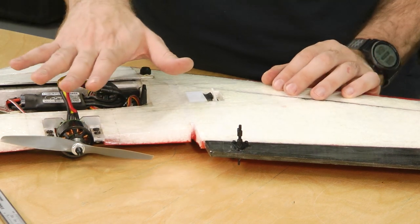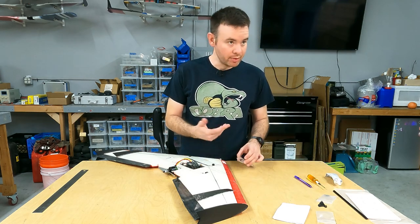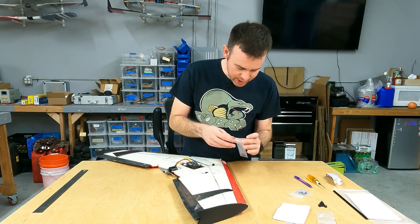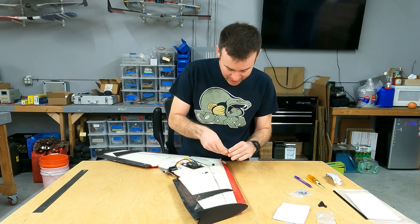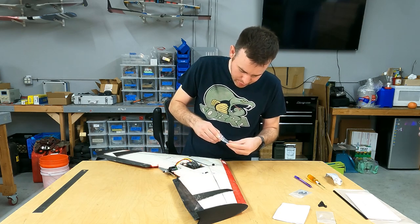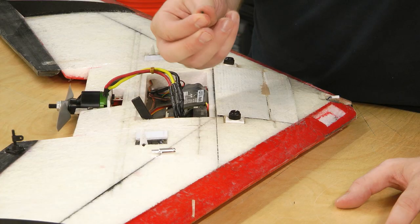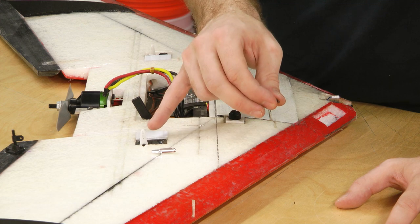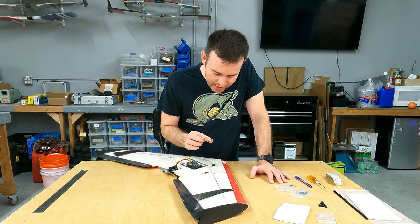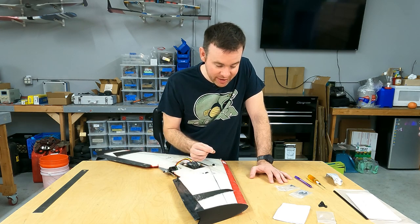This excess shaft we're going to cut off at the end once we're happy with everything. Now we're going to put the clevis on — or the ball, if that's what you're using. The clevis goes on with one of these pins and a C-clip, but we're not going to use the C-clip yet because we're not locking it down. We're broadly going to mock up the length of the rod so we can measure how long to cut our carbon tube. This pin has to fit into that hole — the hole won't be large enough at first, and that's a good thing. We want this pin to fit very tightly, as any movement will be a source of imprecision.